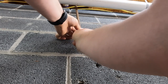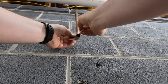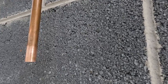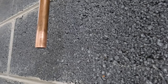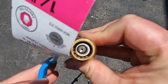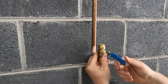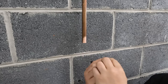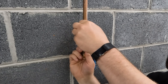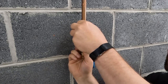We've got all the burrs out of the inside; now we'll take care of the outside. They do make a tool for this, which I'll link in the description, but you can also use sandpaper. Here's a quick close-up of the shutoff to show how the ball valve works. This is a half-inch to half-inch SharkBite shutoff which can be used with both copper and PEX — important because we'll be switching over to PEX from this shutoff. It does take a bit of force to get it going but you'll eventually feel it slide into place.